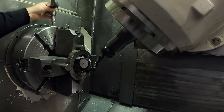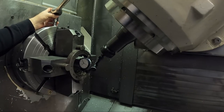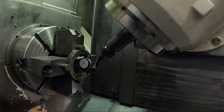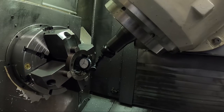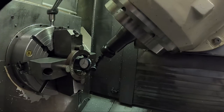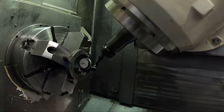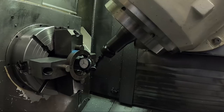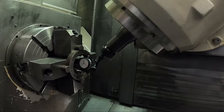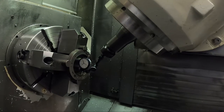I've got this mag base sitting - you can't see it in the screen, but right here on this piece of pipe I clamped to the machine. It's getting in the way of my wrench at the bottom. The pipe might not be round on the inside either. I just want to make sure all my jaws are tight. I think the pipe is not round on the inside, and of course I'm probably distorting it with the pressure of the jaws here too.